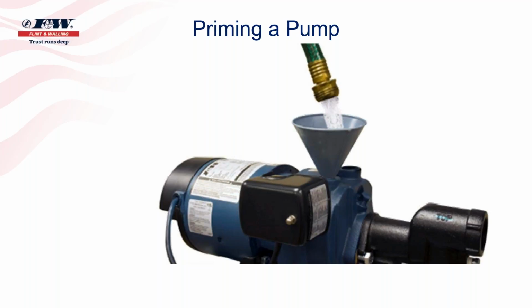But the real key when it comes to priming these pumps is to make sure that not just the pump housing is filled completely with water, but that suction line where that comes into the front of that pump, wherever that goes, you really want to have that full of water too. So the biggest thing I would tell you about priming a centrifugal pump or a jet pump is to have some patience and allow the air proper time to dissipate out.